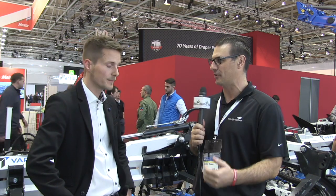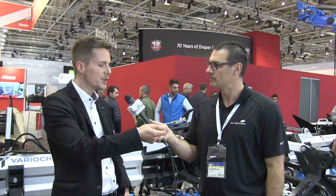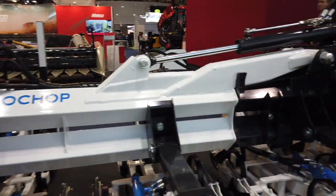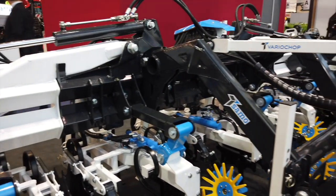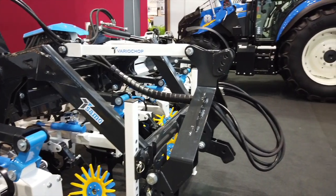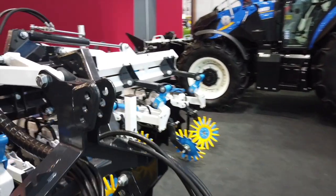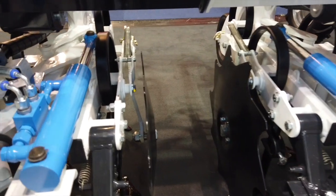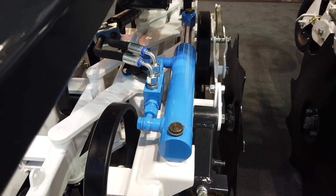So what you're talking about is changing the width of the cultivator — it was taking way too long. Now you've added a lot more flexibility where you can basically do that from the cab of the tractor. You have just a potentiometer in the cab and you are adjusting it from 7 centimeters up to 22, depending on the size of the plant — just from the tractor cabin. Normally you need a wrench and screwing for one or two hours. Now you can do it within seconds in the cabin. That's adding a lot of productivity when you're switching from a crop like corn to winter rape or canola. Even in North America with huge fields where the plant size is different in the same field, you will not stop to adjust the machine again if you can do it from the tractor.